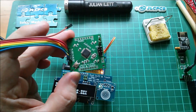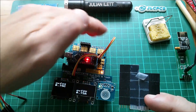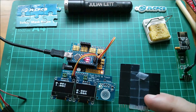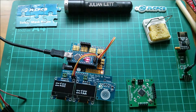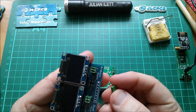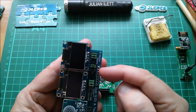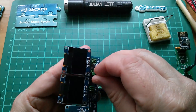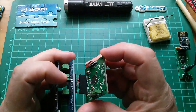Got some funny data coming in and the D13 light is flickering wildly, but that's fine. This activity gives me even more confidence that the OLEDs are working. I bought some 8-way female headers on eBay the other day, so I'll get that one soldered in for the OLED and touch board. A couple of links to route SCL and SDA to their appropriate connectors — it's the first two connectors, A4 and A5 on a Nano. That plugs into that 8-way connector. This is now just providing power, and I need to load in the appropriate program to get some OLED output.